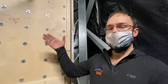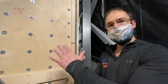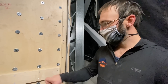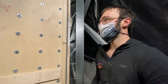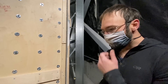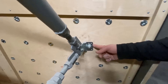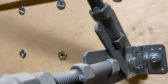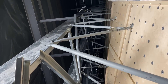We build them in what we call facets, which are basically one angle change on the wall — one flat panel. Wherever an angle change occurs, that is another facet. When you're putting these things together, you have one person behind the wall screwing in from the back, one person from the front placing each square panel. You do that over and over again whilst tying into this steel superstructure. This is a hinge with a three-quarter inch bolt — someone on the front ties the panel to this. Then you adjust all these pipes that tie back to the major structure behind, which is built beforehand.